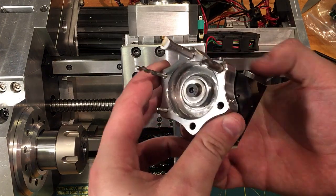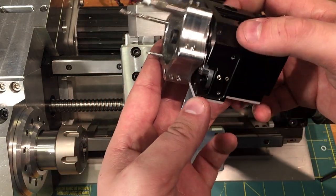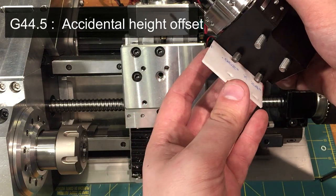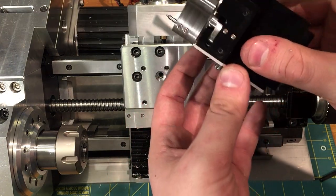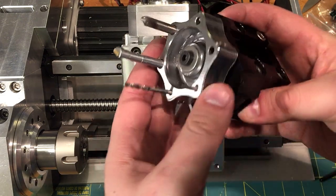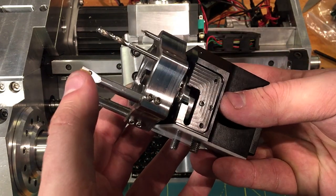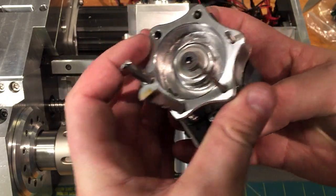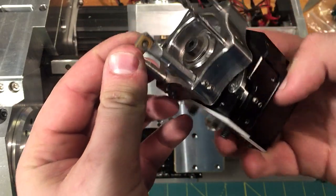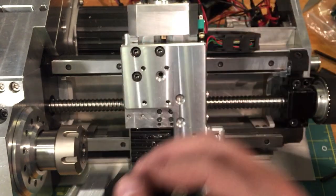So here's the drilling turret. I went over this quickly in another video. I kind of messed up a little bit and put an accidental offset on it, so I had to shim it with some Delrin for now — eventually I'll use a more precise shim to get it just right. I have actually done some drilling with this and it works really, really well, so I'm pretty happy with that. I've got a boring bar on here too with what looks like a destroyed insert. It's funny — when you get this small, spotting drills all of a sudden become sort of your workhorse drills. And there's an itty-bitty little center drill there too.